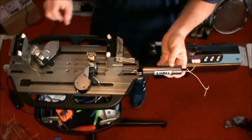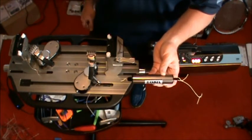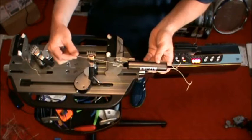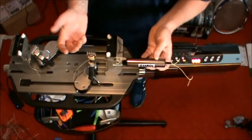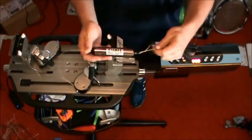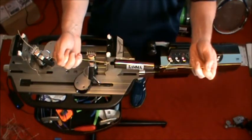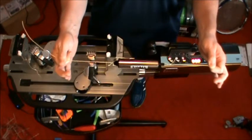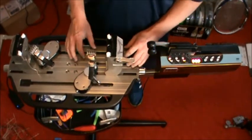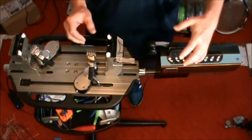If you don't have Kevlar and you've got a thick, stiff polyester that doesn't stretch very much, some 16 gauge stiff poly, maybe put that on your calibrator as opposed to just putting some synthetic gut or some nylon on there, which can slightly affect the reading. So this is Kevlar, and the reason that I'm not showing you right now is the tension is not going to drop on this very fast because I have a super low elongation string, Kevlar string attached. So right now, if I were to demonstrate using a Kevlar string, you wouldn't see this tension drop very much.